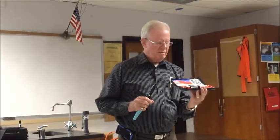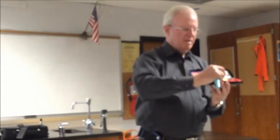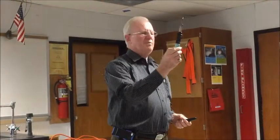This is another very nice iron to have, butane, because this triples as a hot knife. It'll cut nylon and Dacron, and it also puts on heat shrink tubing. So you have an iron, a heat shrink gun, and a rope cutter all in one. These are $65 on Amazon. This is the Cadillac or Ferrari of all of the butane irons I use. This is the Weller Pyro Pen WFPA2. They're about $120, but man, do they get hot. I think you guys saw me use this before.